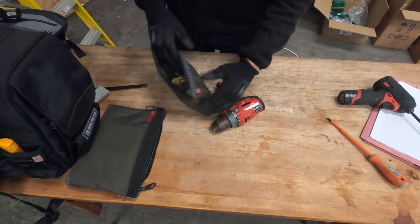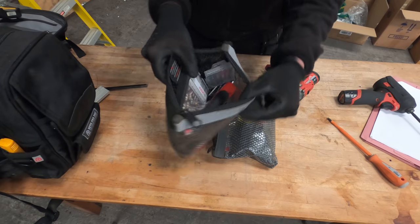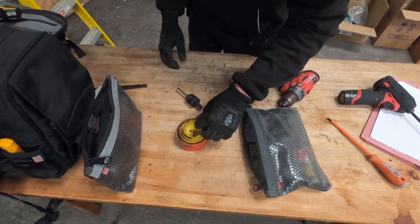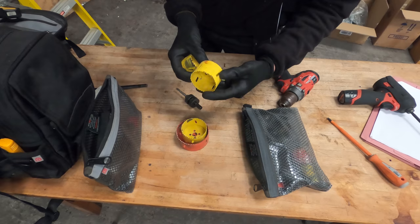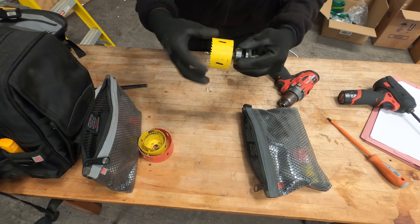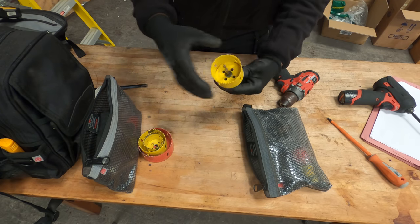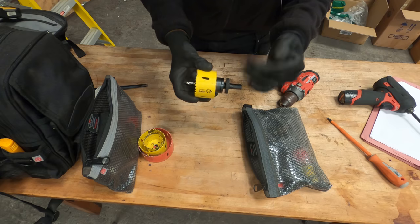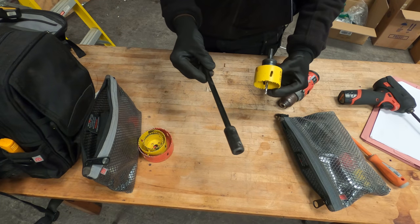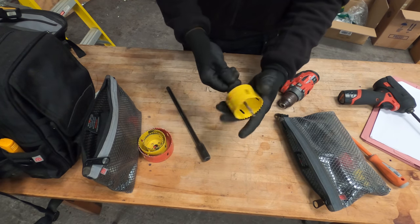These are just some parts bags I'll have in the back of my tech pack to hold hole saws and drill bits and all sorts, just to keep it all tidy. We're going to need something around a 64mm hole saw at a downwards angle, which should allow us to get a nice sweep on the cable as well. I did get my extension bar out — these are dead ends so they just extend the hole saw — but it's probably not going to be necessary. So we'll drill that through.